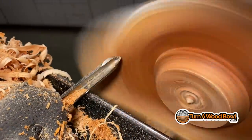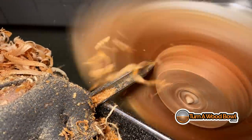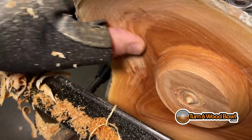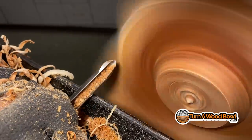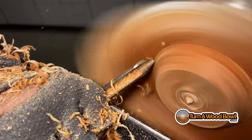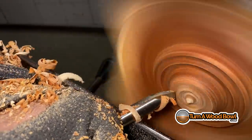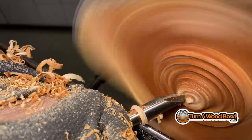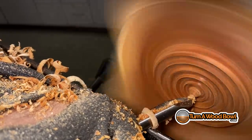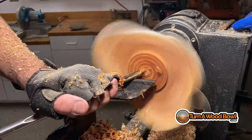With that mass in the center, those small protruding side wings are very stable. I'm working down maybe an inch to inch and a half — about two to three centimeters — of that wall at a time. Once I've established even wall thickness in an area, I don't go back up the wall, because the more of that center that gets removed, the more those wings and sidewalls will vibrate and you won't get a smooth cut. Only use a very open cut — flute at about 12 o'clock — when making a very fine finishing cut. Never do that in any other circumstance because it can lead to a lot of problems.